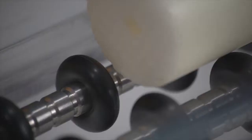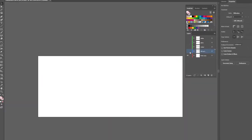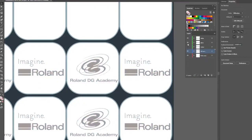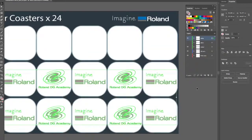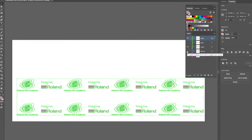For printing cylindrical items, there is a rotary unit available for LEF devices. You need to make sure that your design files match up to the template that you're using for your jig. You can do this by creating an artboard or a bounding box for an EPS file. You can separate your layouts and graphic information onto separate layers and only export what you need, keeping all of the information in one file. When using VersaWorks Dual, the zero-zero position is in the top left of the preview display, so just double check your alignment before printing your design file. If the file is the same size as the printable area of your bed, the files should marry up perfectly.